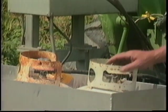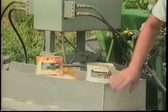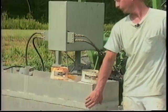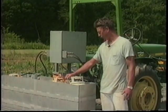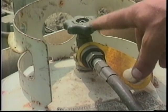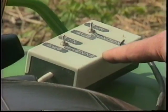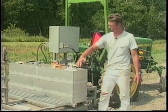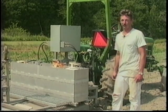This is a vapor system. It has four 20 to 25 pound tanks that go in this reservoir of water. This tank is a reservoir filled with water, which is heated by a small burner, which keeps the water warm and keeps these tanks from freezing. We use the gas at such a high rate that these tanks would freeze up and gas would no longer be available. There are shutoffs on each tank, a shutoff inside the control panel, and an electronic shutoff for the burners and the pilot. There are six burners across this four-foot space, producing very high BTUs.